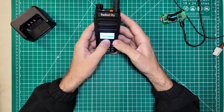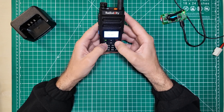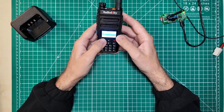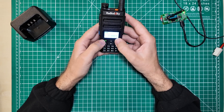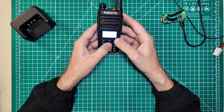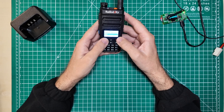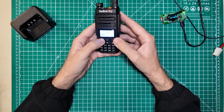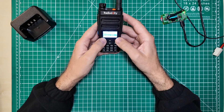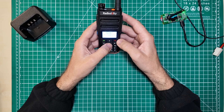Menu: GPS zone, satellite — location not set, GPS. This radio doesn't have GPS, so the satellite thing won't work. Zone one — not a whole big code plug in here. Contacts: DMR contacts, a couple of talk groups, FM DTMF contacts. Channel details, RSSI — it's currently receiving minus 115 dBm, because nothing's going on around here. Firmware info: built 2023-12-31. I'm sure there's a newer version, so we'll have to play with that.